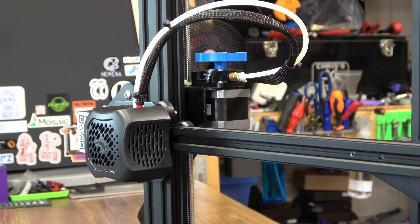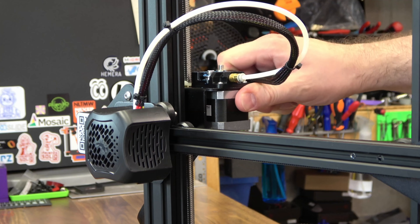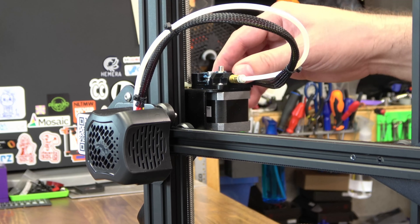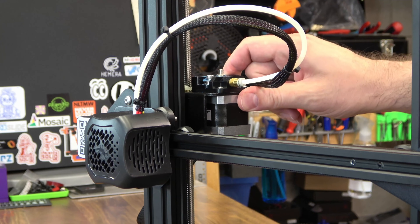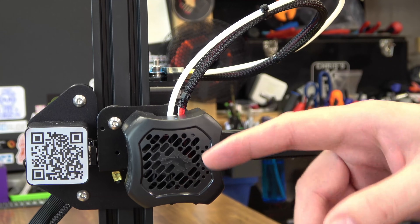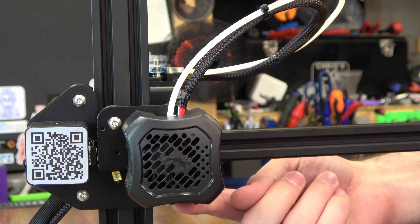The extruder setup is almost exactly the same as the original version. You do get this fancy knob to help you advance your filament, but it's the same plastic Mark 8 extruder arm with the Bowden setup and the same hot end with the PTFE tube that goes all the way to the nozzle. This was probably the biggest disappointment about the V2 — I think they should have upgraded this part as well, at least gone with a metal arm. But it still does work. You do get this respirator-like cover over the hot end, but you're still getting the same fan and part fan. The hot end is identical to all the other models — just looks a little fancier. You do get that silicone sock again.